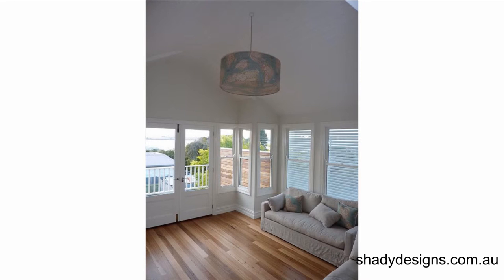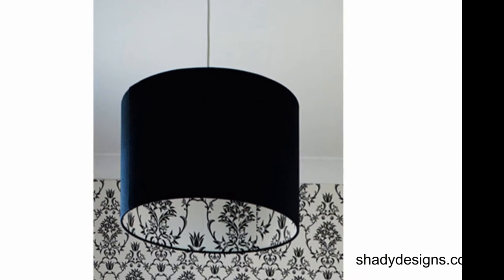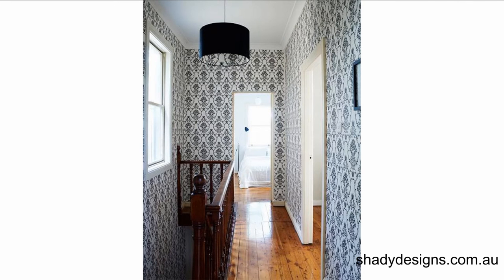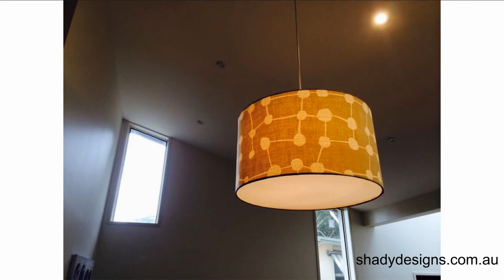The way that we measure the drop of the lampshade is we look at the floor to ceiling height. We know that we need a space of two meters from the floor to the bottom of the shade. Think about how tall your lampshade is going to be — most often they're about 30 centimeters tall, so that's 2.3 meters from the floor to the bottom of the shade. The drop is the space between the ceiling and the 2.3 meter mark.